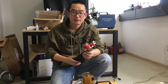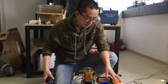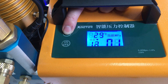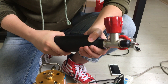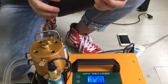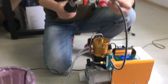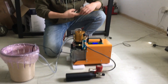Actually, our display has overload protection. That means if you set 20 MPa, the actual pressure in the bottle may be 18 or 19 MPa. So if you want to fill it to a real 20 MPa, you prefer to set it to 22 or 23. Okay, so I will test it and I will time it by my phone.